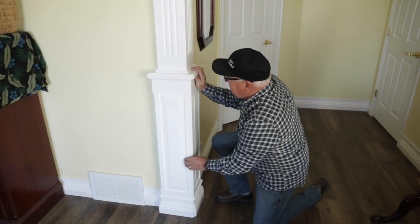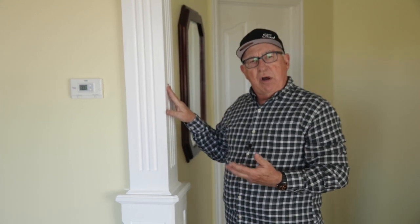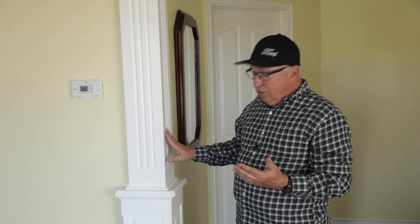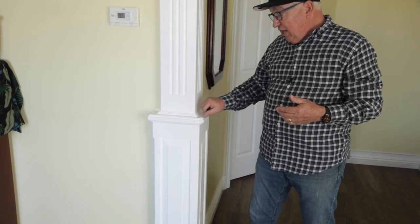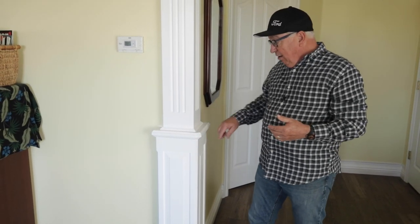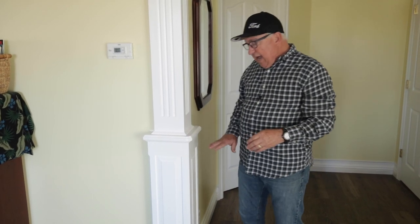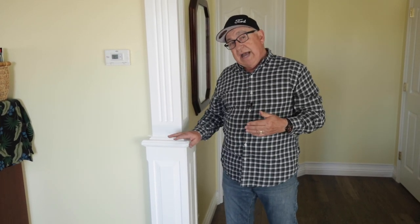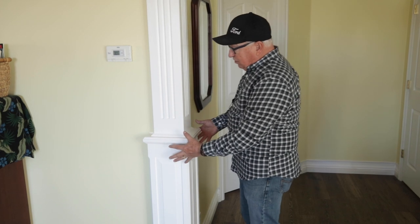It was thought out. So now we have right up here to 40 inches. There are literally hundreds of different ways to approach this, and if you're a purist you're probably looking at this and going, boy, he borrowed from all sorts of styles — and that's probably true. I kind of made this up a little bit as I went. One thing I did is decided to put a 45-degree chamfer all on this leading edge and match it and telegraph it to the cap here. I thought it softened it, gave another shadow line, another reflective surface, and it makes it more durable because hard edge corners tend to get beat or nicked pretty badly. So that softened the look right here.